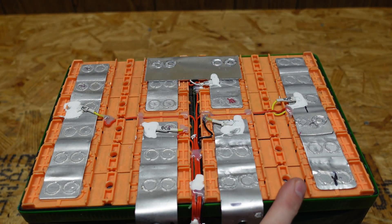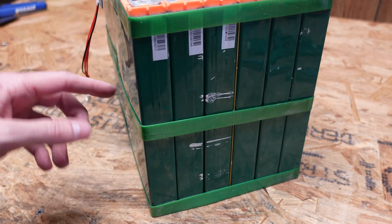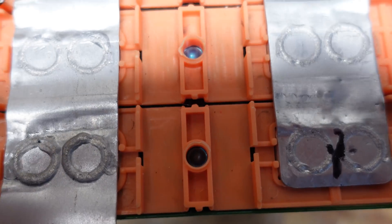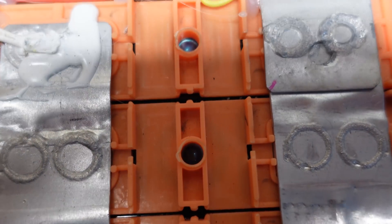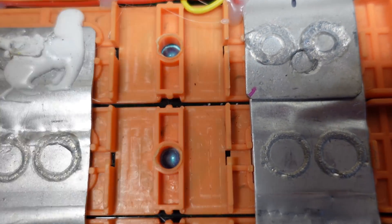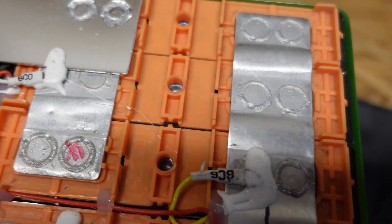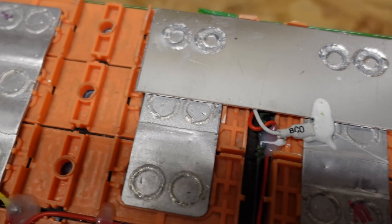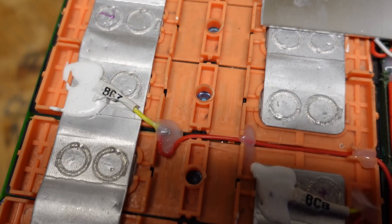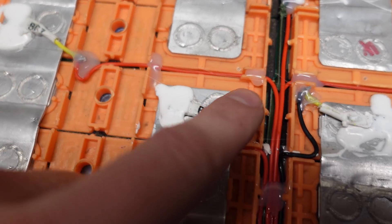Let's see what we've got for voltage. That battery pack is 0.2 volts. Then we've got 2.50 volts, 2.28 volts, and 2.35 volts. So this first battery group is definitely the bad one. I don't know if maybe that BMS over-discharged it and the bulging is caused by the over-discharge. Looking at the bad cells, I don't see any signs that any of them have leaked. The laser welding does look decent — pretty good actually. The balance connections are on there well and they're glued down so they don't pull out.